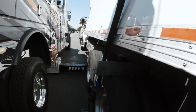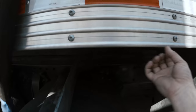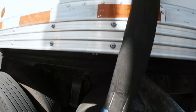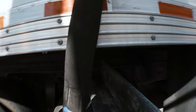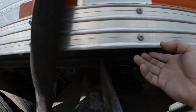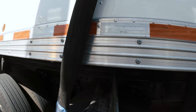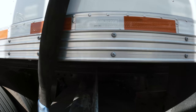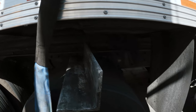Those are my boxes. Now with these angle irons, they're pretty nifty. Incredibly strong. You would put them here, so when I lift up, it's not just putting pressure on the width of the strap and crush this. This spreads it. So I would put that parallel to the body flush. When it's time to tighten up, as soon as Joe finishes setting up the other side, do that on each end and it'll protect all this and come up evenly. So instead of just the width of the strap picking this up, now it's the whole width of this, which is like 2 feet wide.